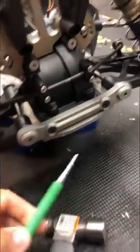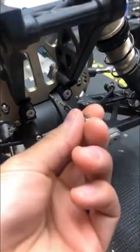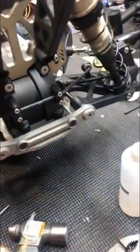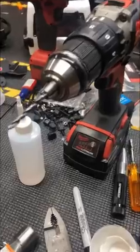All right. Because the last thing you want to do is start drilling and, as you put this against the flat spot, it'll start moving all around. So if you make a center punch right in the aluminum where you want it to start, this will make it a lot easier to stay where it's got to be, and it'll drill right through. So let's see how it goes.